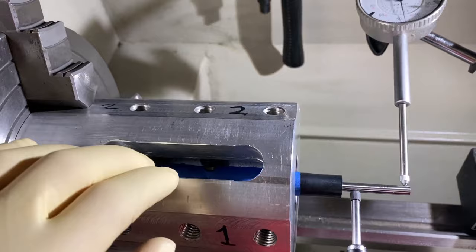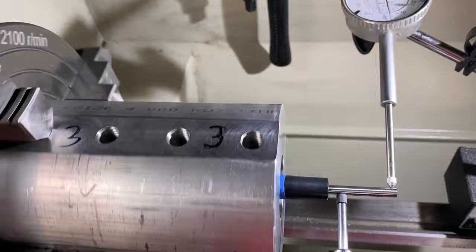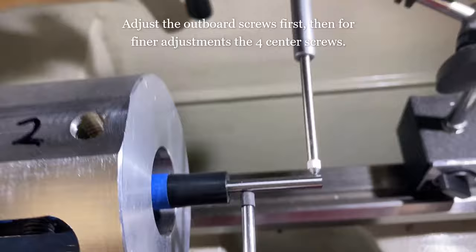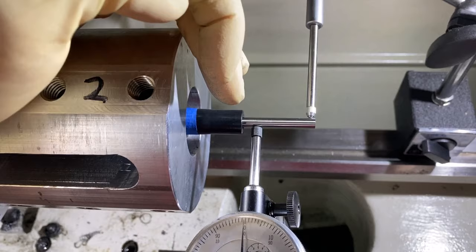So here's your jig. This hole right here is for bolt handles, and basically you have three adjustment screws on four sides. What you do is you're going to put your gauge pin inside the inner bore, and before you cut your threads or do a crown or anything like that, you're going to want to have it perpendicular to the trajectory of the round. By doing this measurement, you'll have the most concentricity between the center of the bore and the outside of the threads that you're going to cut on the barrel.